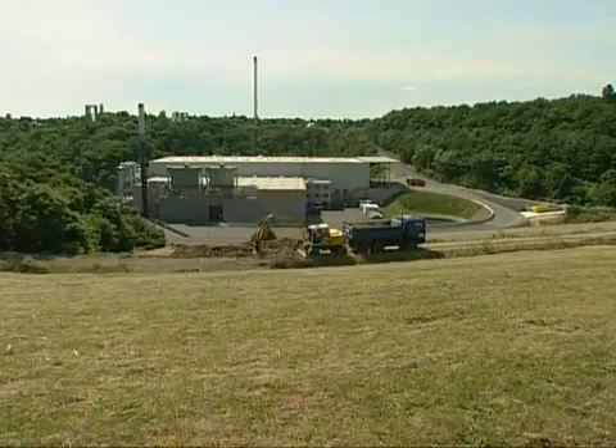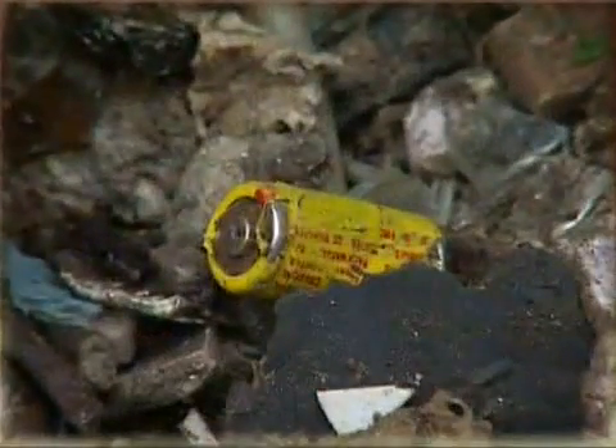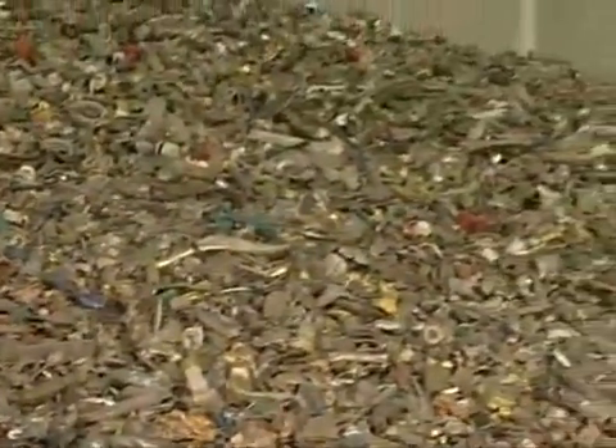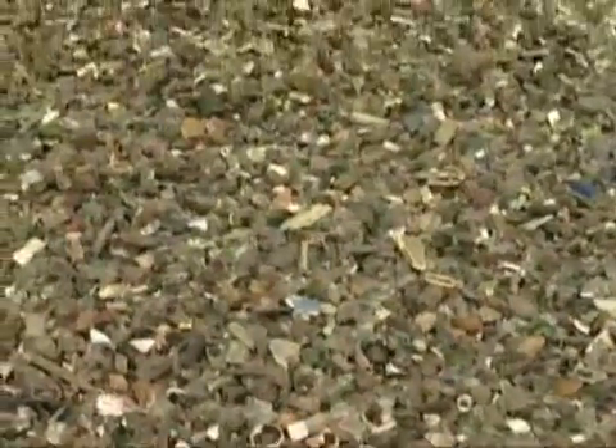Let's go back to the non-combustible components in the waste. Whether it's a spoon, a cup or a beer can, practically everything can be sorted mechanically. The process separates ferrous and non-ferrous metals from the mineral fraction by the use of magnets and eddy currents. The only things that must be removed from the ferrous stream by hand are old batteries. The separated metal fractions are recycled — recovering aluminum from waste materials conserves energy, as producing aluminum from bauxite is energy intensive. The remaining fraction can be used as cover material or further cleaned for use in road construction.